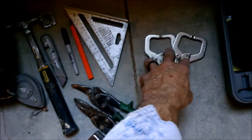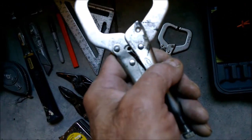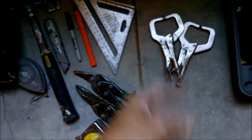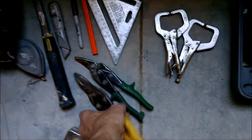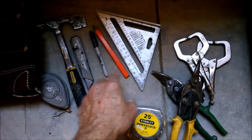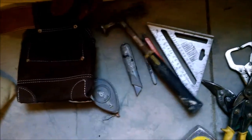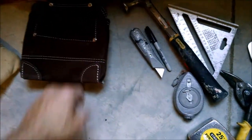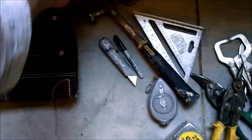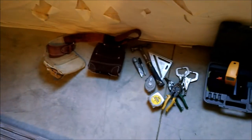Here are your basic hand tools. You've got to have at least two pairs of small six-inch vice grips. I like to have a right and a left pair of snips for weird cuts. Tape measure, speed square, pencil, Sharpie, knife, hammer — I use a sheetrock hammer — and a chalk box. Those are your basic tools for metal stud framing.